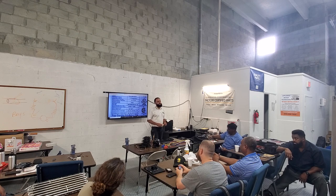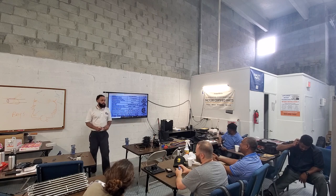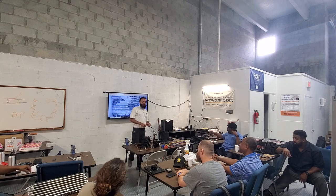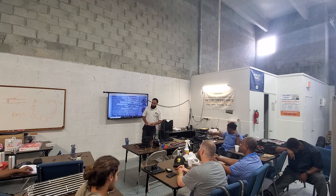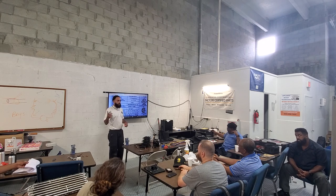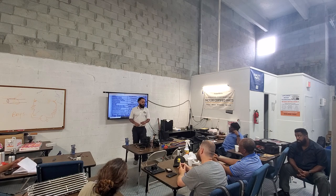Yeah. You have to test it. You gotta get your gauges off. We're gonna put our relay on. If this is an old school one, I mean, you talk about LG, then you gotta do the jig. Yeah, I'm saying we can get into that. And I brought a jig, so we will do that. But nonetheless, hold on one second. Put our relay on, overload capacitor. Put the unit at 037. We start it. We get our amp meter. We hook it up to the compressor.